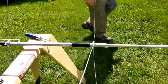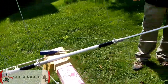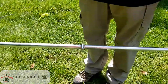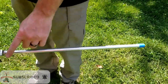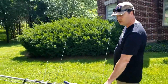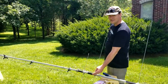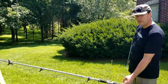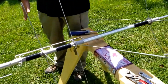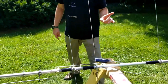What we also saw in the instructions is that this final pole up here at the top, to give it the additional length, is also a part of the 40-meter band. We've lengthened this by about 3 inches because that seemed to be what the instructions indicated. We did not touch the capacity hat for 40 — we may have to come back and check that. Then we went to the capacity hat for 30, and we've shortened it because it was tuning low on the band — we needed to bring it up. You actually shorten the spoke to do that, and you only have to shorten one of the spokes.